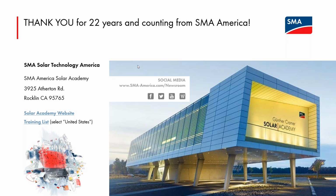And while we're selling it as an accessory kit, I believe it's RayCap. They're the RayCap modules for both the AC side and the DC side. So those would be installed interior to the inverter. Obviously, if you have a 600-volt transformer there between the inverter and building service, there may be areas that wouldn't have that protection, but coming into the inverter from the utility side, and also on the DC coming from the array to the inverter, you have that protection. Having said that, I don't think SPDs are going to protect an inverter from a close-by lightning strike, but it is better than nothing. And we do offer those, just so folks know.